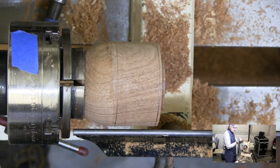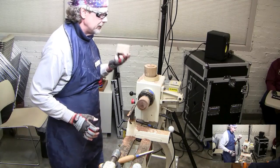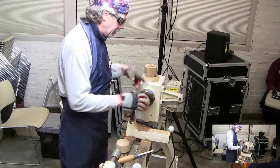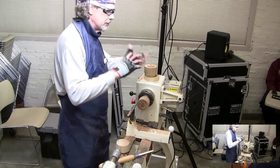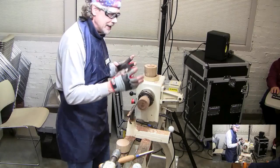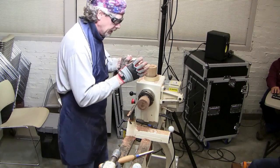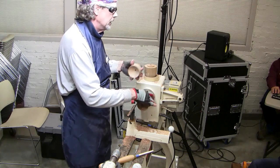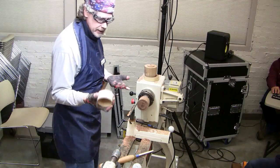Now, this guy, when it comes to softer woods, still can give you a more perfect sphere, because if you're clamping onto the wood, the wood can be harder or softer on different sides. It's not necessarily going to be as true as jamming something into this, where you're essentially holding onto the outside edges of the piece. So this has its usefulness, even in just doing the spheres.